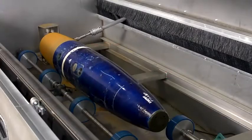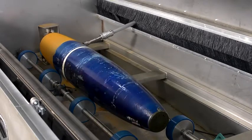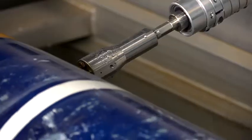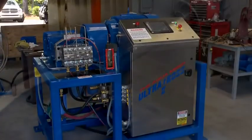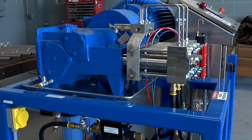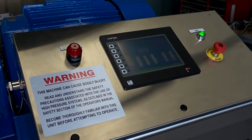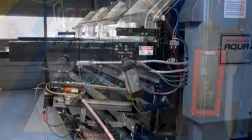The RBB can accommodate cylindrical objects up to 12 feet long and up to 40 inches in diameter. It uses high pressure water to blast the surfaces clean. The high pressure water is produced by our model E75V water blasting unit with a variable output up to 40,000 pounds per square inch at three gallons per minute.